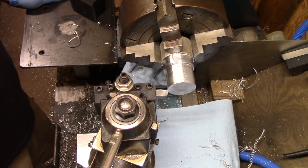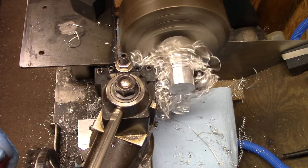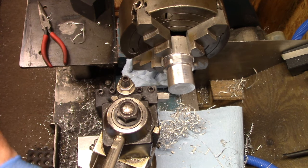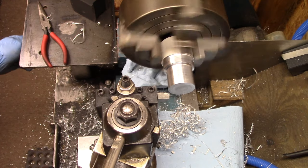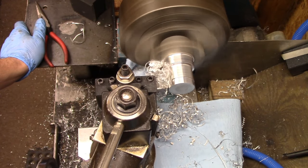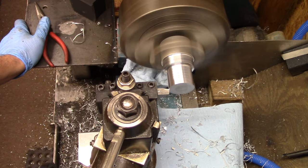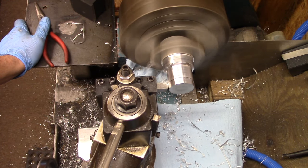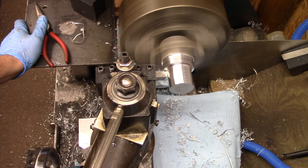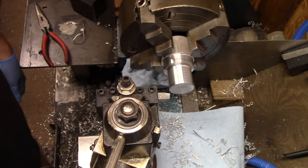I said a millimeter and a half - let's try a millimeter. Just not breaking a chip at that size at all. Try about 0.75 this time to see if I can break a chip. Still bird's nest. Trying 0.6 - looks like 0.5 or 0.6 is where I'm going to be sticking. That's giving me decent finish and I'm breaking chips.